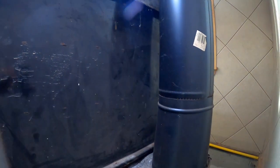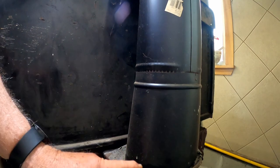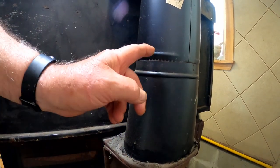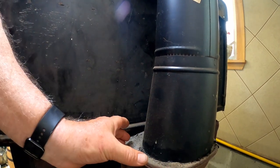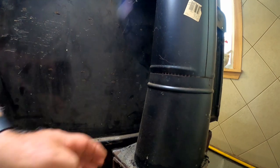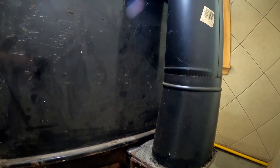First off, we have the lower bell — this is a 7-inch to fit the stove and then a 6-inch to fit the chimney. This is a standard configuration. The reason they made it oval is it took up less room between the stove and the wall, and it would still carry the same volume of smoke.